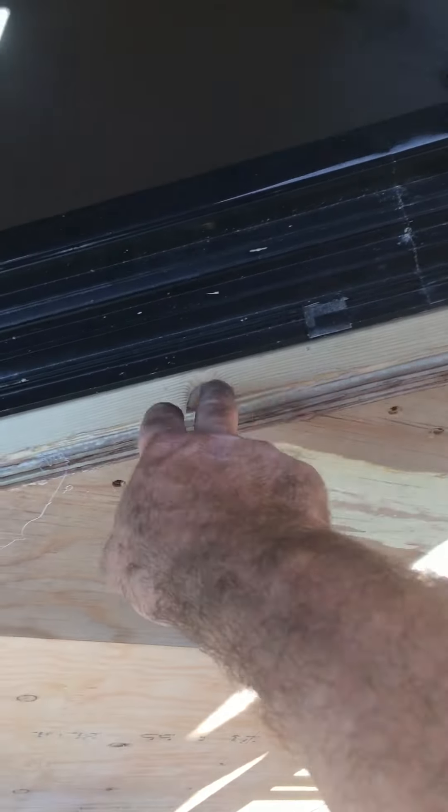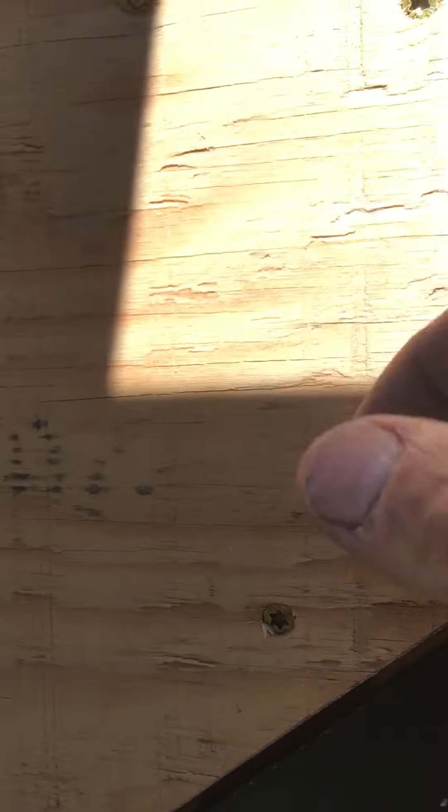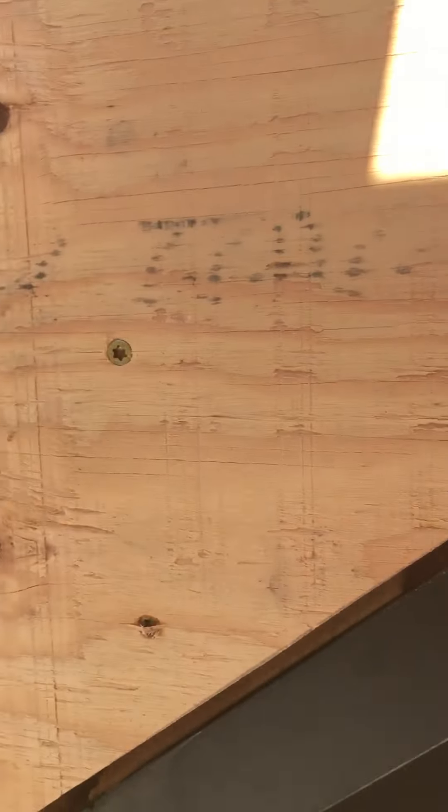We'll do the emulsion first — actually cut this out, hit it with emulsion, take the window out, and do the emulsion around the whole window opening. Then we come in and set the sill, set the frame, and spray foam insulation around the frame leaving room for expansion or deflection, using flexible spray foam.